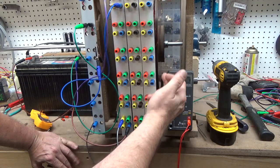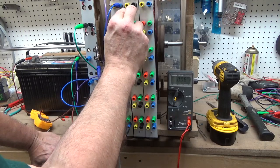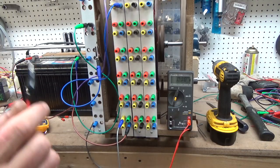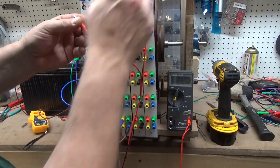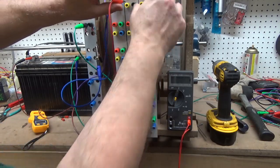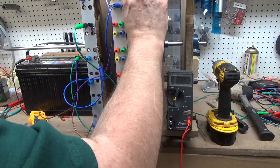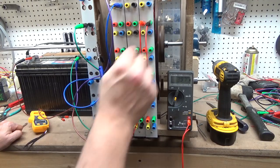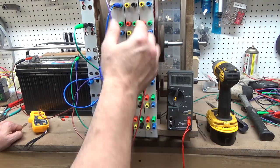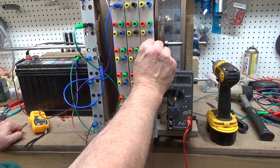The ones in blue are 18 ending, and the ones in black are 18 start, 23 ending. So about every other stator is the other way. So anyways, to the AC voltage here. At that RPM, we got 4 volts on our 18, 1.2 volts on our 23, and I've already checked these, they run pretty consistent around 4 volts, depending on the RPMs. At higher RPMs, which I've had this thing up to 1100 RPMs, it's way more voltage than I want.